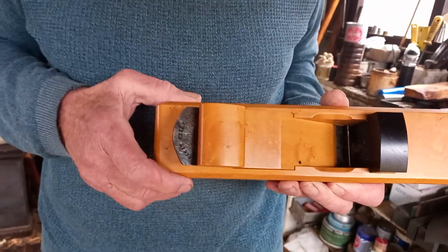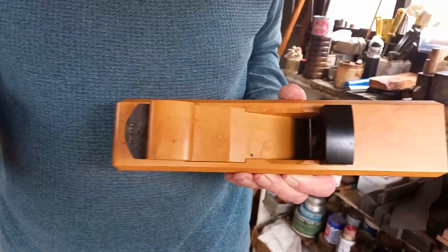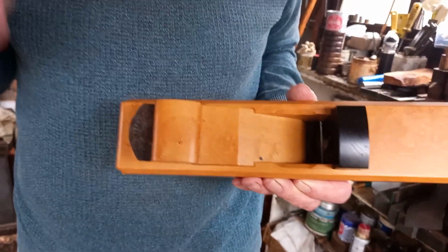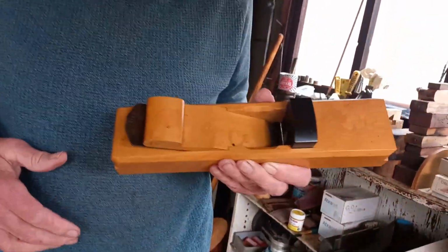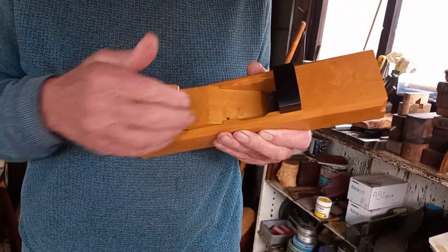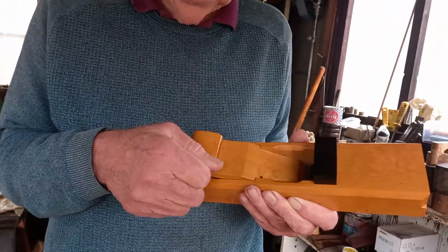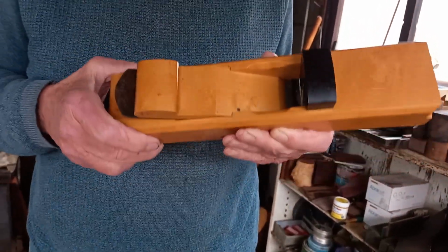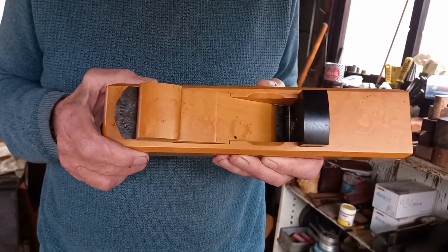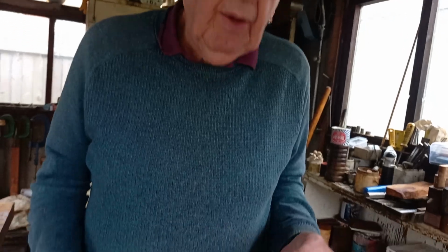I used a blunt chisel technique, which I have done a video on somewhere. Out of all the 9 planes I made in boxwood, I could not chisel that waste out from either end. It's all interlocked. I had to come up with a piece of steel, actually. I blunted it and used it like a float or a blunt chisel. That's how I overcame that problem. So I think that just about covers it all.